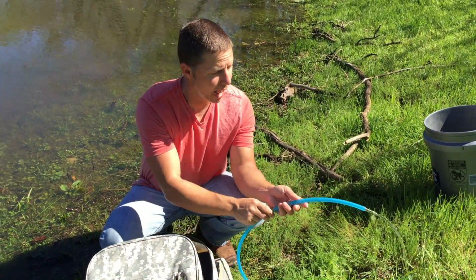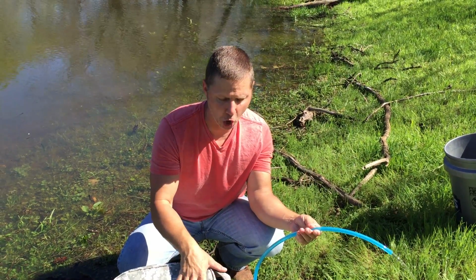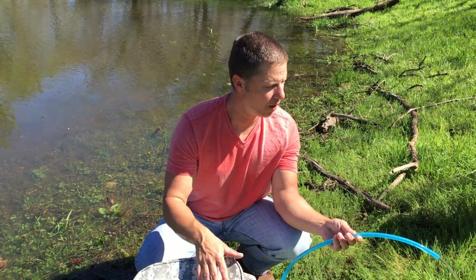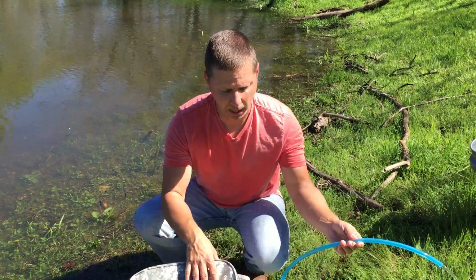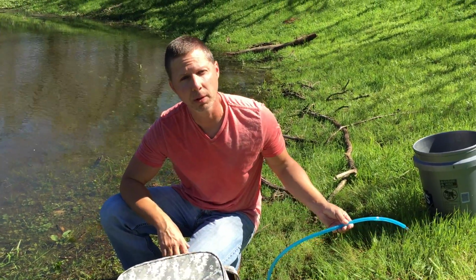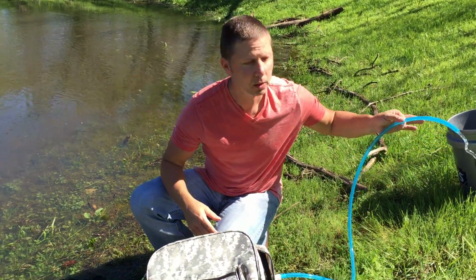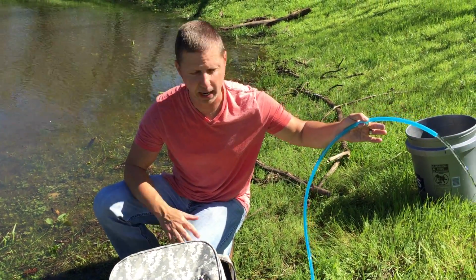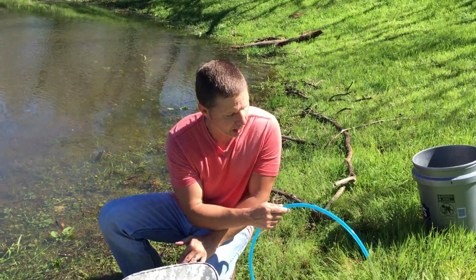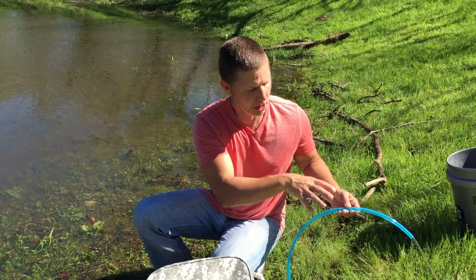UV lamp indicator's on. You're actually now ready to start collecting water at a gallon a minute. Off of one charge with the battery supply we provide, you'll get about 30 to 45 gallons of water. Now, we always recommend that you only run the hydro in about 30-minute increments. This will prolong the life of your pump tremendously, okay? But you're actually ready to start collecting water immediately. Put this in a nice sterile gallon container. We're actually going to start having some BPA-free plastic containers that you will be able to purchase and collect your water in as well.